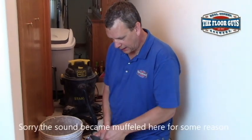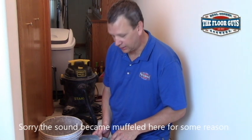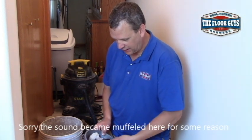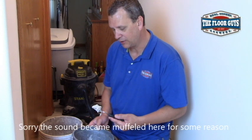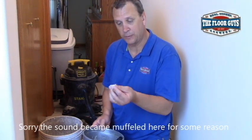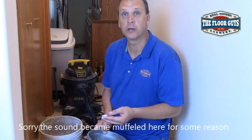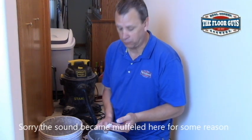We're back. I mixed up the grout according to the directions on the package — I only mixed up a little bit. You kind of want the consistency like peanut butter, and that's kind of where we're at. You don't want it too watery where it's running all over, and you don't want it too dry where you can't move it — it's going to flake out if you do that.